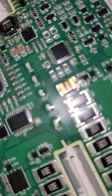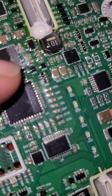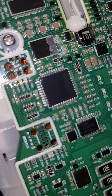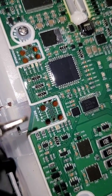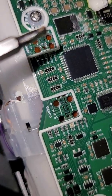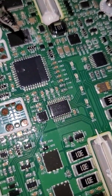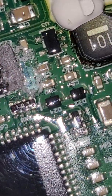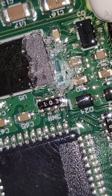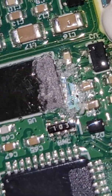Once you get this out, you're gonna notice it has a film of protection on it. You're gonna have to remove it on this chip right here — for reference, it's on the debug side. You see where it says 'debug' right there, and then 'program' — it's right next to the program side. I've already removed the film; you kind of have to scratch it off a little bit. Once that's scratched off, you'll see those two contacts right there — those are the two contacts you want to short out.